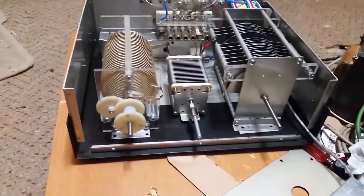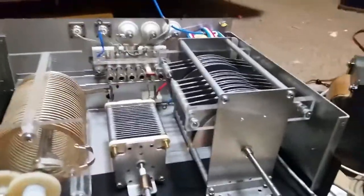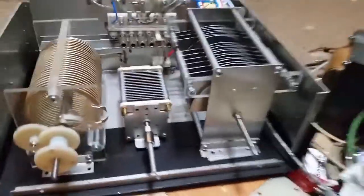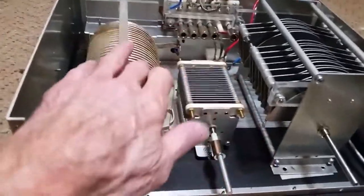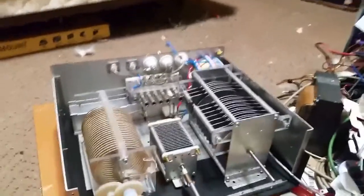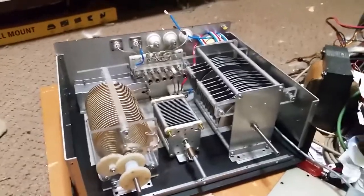Yeah, don't look too bad. I'm just hoping I don't get a little bit of capacitance between the input and the output cap — I'm sure I will, but I can pretty much take care of that. Down here you see two holes — I can build a shield for them. I could also come up off this side and shield from the main inductor. Somebody disconnected the balun — the long wire balun — so I gotta figure that all out. Luckily I got the schematics so I can try to put it back to the way it belongs.